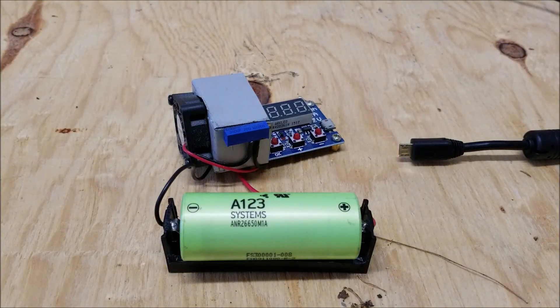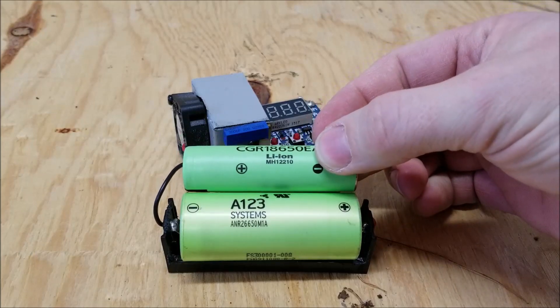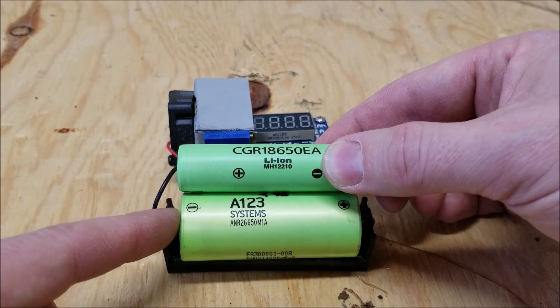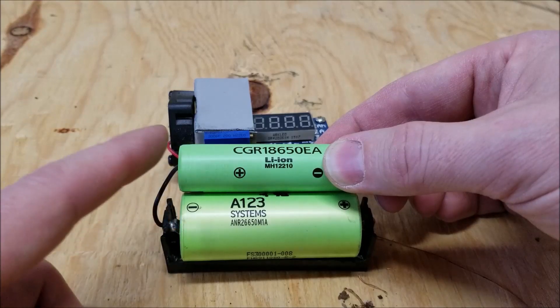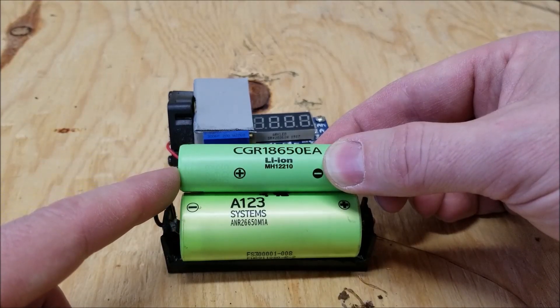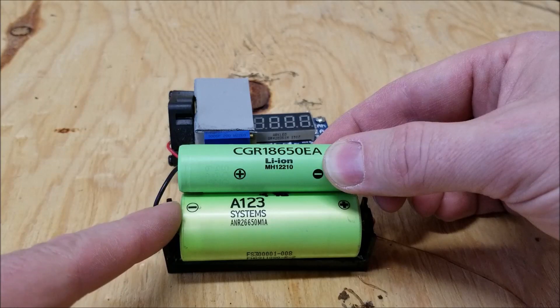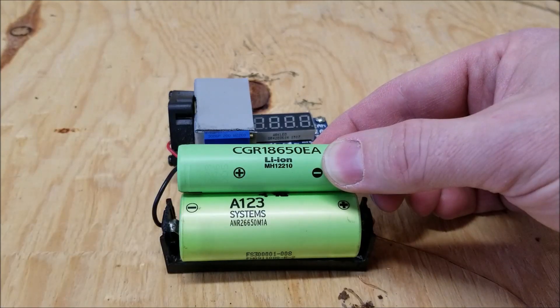So that's how I tested these batteries. Just to compare, this is a standard 18650 — you can see it's quite a bit smaller but it's the same length. These two cells actually have a comparable capacity, I think these were 2.3 amp hour and these were 2.5 amp hour, if I'm not mistaken. But these cells are designed for a much higher discharge rate, able to sustain 60 amps continuous, and also they're a much safer chemistry. So that's it for today — hope you liked my video.